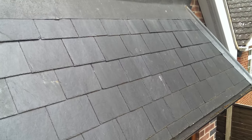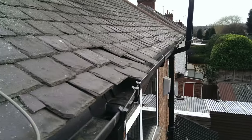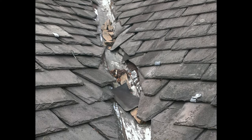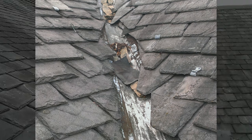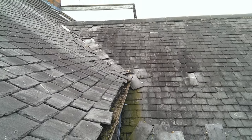On a nice roof like this with a few cracked slates to replace, that's chicken feed. But if you're working on end-of-life roofs, as a lot of us tend to do at some stage, then a few packs of haul hooks will make repairs expensive in comparison to lead or copper tingles that's only going to cost you about a penny each.